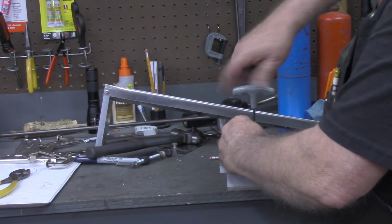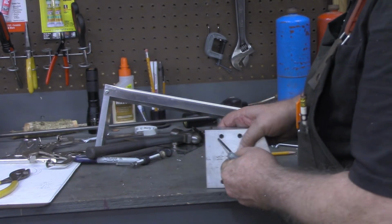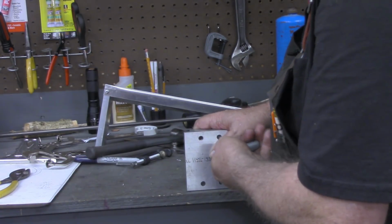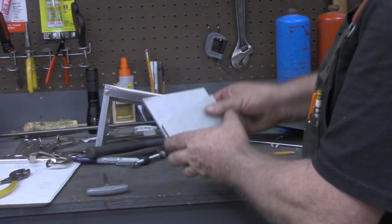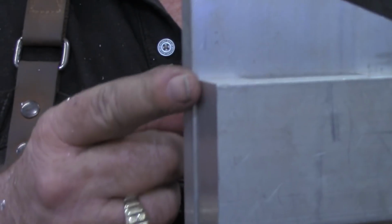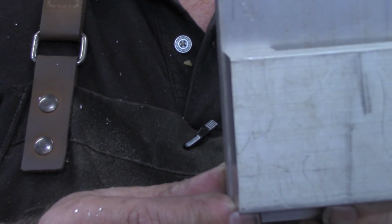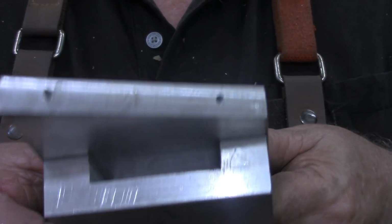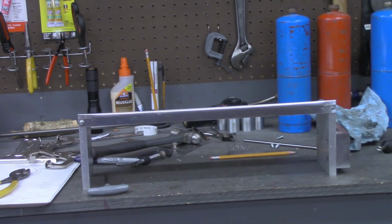If anything, I may have one hole there. It's either got a burr in it or I didn't counterbore deep enough. I think it was just a burr in it. All right, there's the pocket. And hopefully you can see that it is centered. Remember I said I didn't want this to come out right flush because of this roll on this. So I milled that 100 thousandths short. And there's what the pocket looks like for the remote to set in. That's what it will look like assembled.